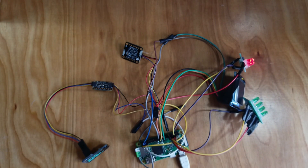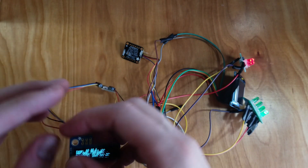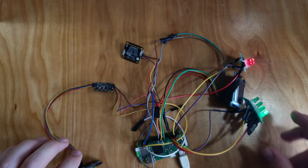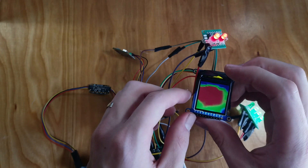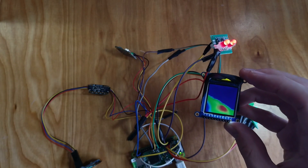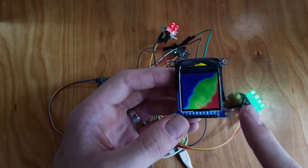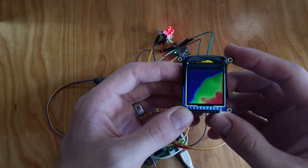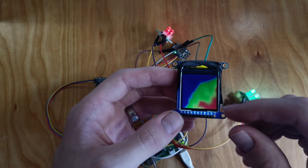The code for this is all written in Python, and it's pretty straightforward. The environment code just takes the raw values from the sensor and spits a formatted version out to the OLED display. The thermal camera code is a bit more complicated, as it interpolates the 8x8 grid from the sensor into a much larger grid so that it appears like it has better resolution than it actually does. Adafruit has a pretty good tutorial for this, which I'll link down below. One thing I found tricky is that that tutorial uses Pygame, which I couldn't quite get to work on this Raspberry Pi, so I used the Python Imaging Library instead. More details about that code are in the project document in the description.